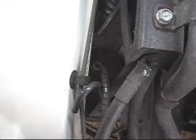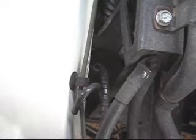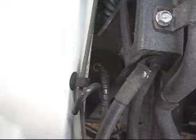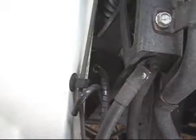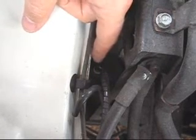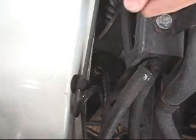Hi, this is Story Wilson and I'm going to show you how to check your O-rings and the high-pressure airlines, inspect them for leaks. In a previous video I showed you how to detect leaks using soapy water. We're going to pull this airline, inspect it, inspect the O-rings, and I'll also show you how to best depressurize it so that when you unplug it you don't get a huge face full of compressed air.